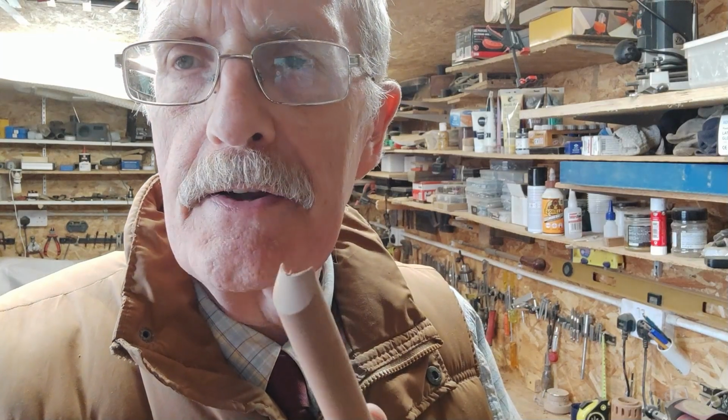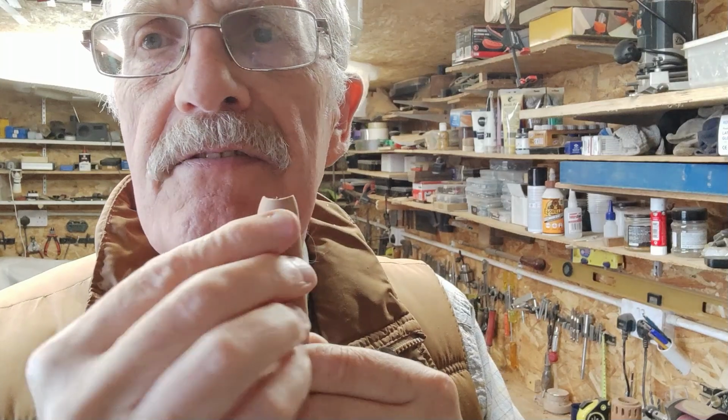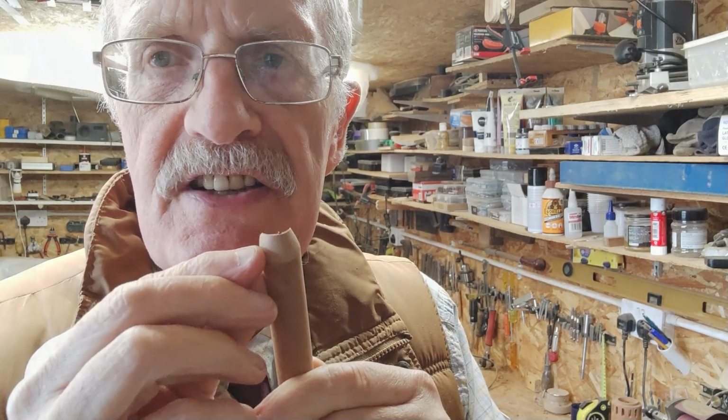So you didn't grind a lot of the steel away. I mean, tools are very expensive, so all you really want to do is get the basic shape and just keep on top of the edge. So I'll show you how I used to hand grind. I can't do it now as well because I've got tremors, essential tremors, so I'm a bit tentative when it goes onto the grinding wheel. And you want a nice clean bevel if you can manage it, with very little facets.